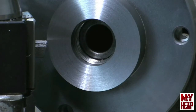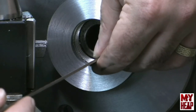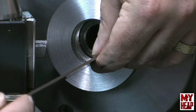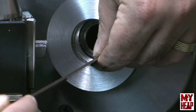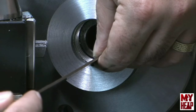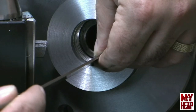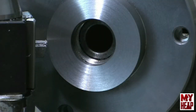Let's get a measurement. My ruler is graduated in 16ths, 64ths, 8ths, and 32nds. I'm looking for 8/32nds and I'm about a 32nd over, so that's about 30 thousandths. I'm going to take two more passes — another pass at 10 and another pass at 5 — and then I'm going to turn it around and try it.